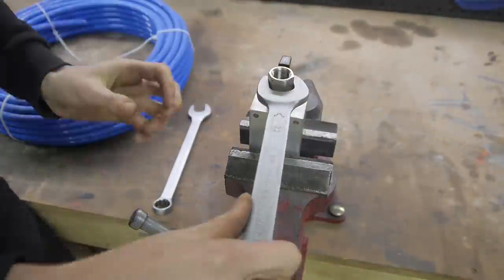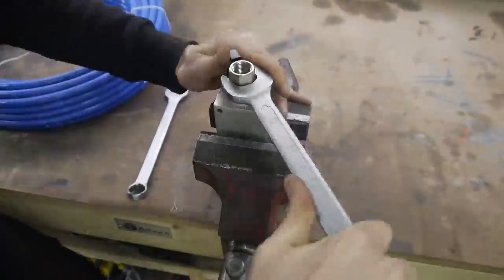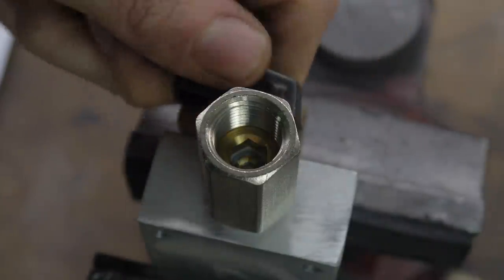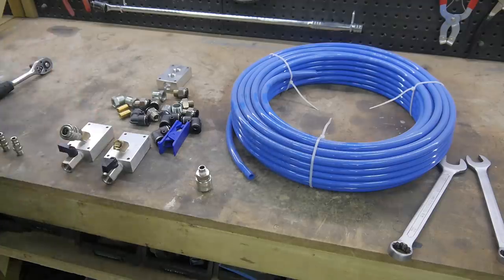They also use a half-inch hose which isn't a standard size for quick-fitting connectors, so I have to buy more rapid air fittings from them, which is kind of annoying. Next time I do this, I'll go for a more generic setup from a local supplier.